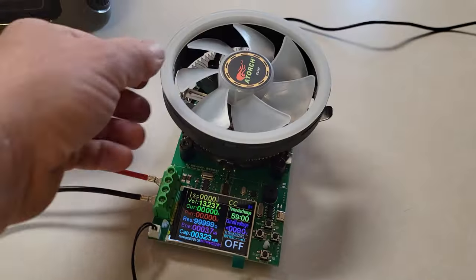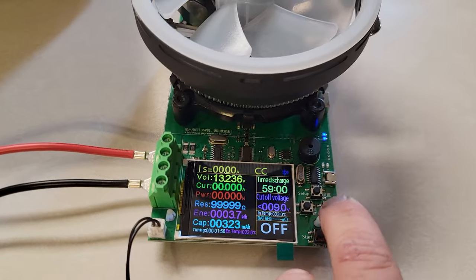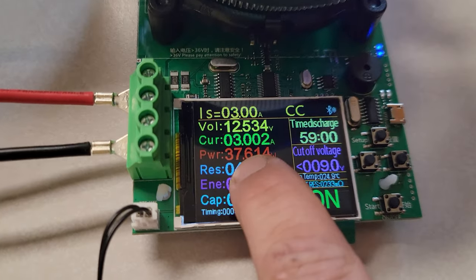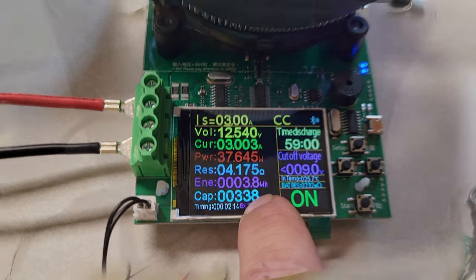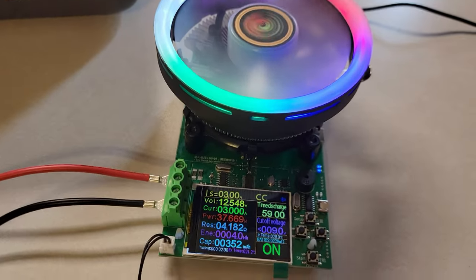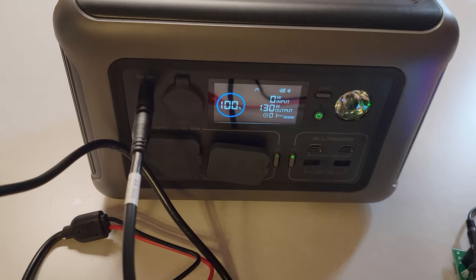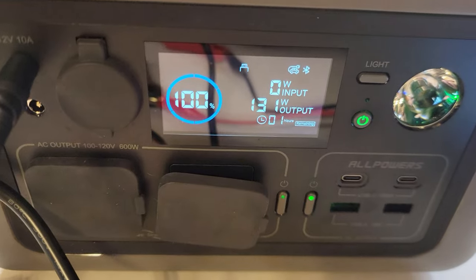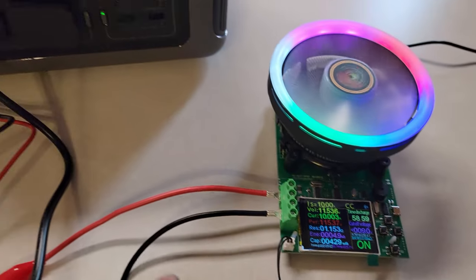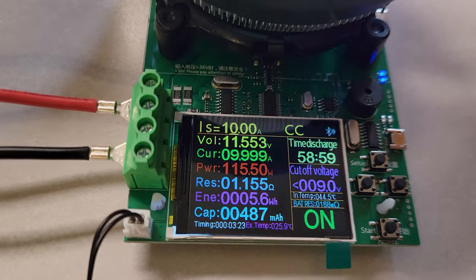This test is going to test the DC battery pack using a load generator. Right now our voltage is at 13.23. Let's test it at a 10 amp load. At 3 amps we're already at 12.5 volts, running 37 watts. We're also going to be doing this on the USBs to verify that they truly can put out the wattage they're rated at. We're stepping up — at 11.5 volts DC, right at the 10 amp mark. That equates to 130 watts, though the power display shows 115 watts, which I attribute to voltage drop through the panels — that's why I went with the heavier cables.